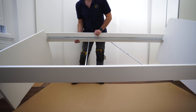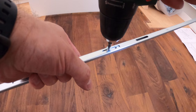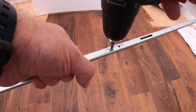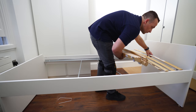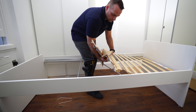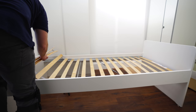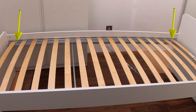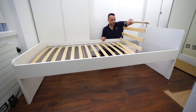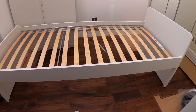Now we're gonna put the bed down. We have the bed in the right position — 90 degrees in each corner — and we secure those two locking screws. Bed slats: this is the classic Luerøy bed slats. Put the first slat over the stoppers we installed previously and place the bed slats along the bed. Place the last slat behind the stoppers as well. You have two stoppers on each side — four in total in each corner — to prevent the slats from sliding off the rail.